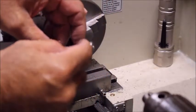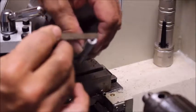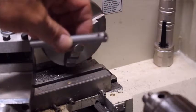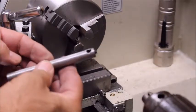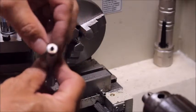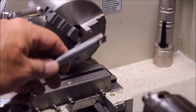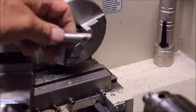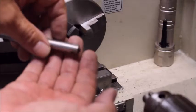I'm going to have to make this hole bigger and then file it square so that this piece of steel will go through. You'll see how much meat it has on each side, and then I'm going to cut this down to size — that will be my boring bar tool. There's the boring bar tool holder with a circular hole that we're going to file square, and you can see the little grub screw in there. This is not my original idea — I got it from somebody else, which is like most things on the internet, but I figured everyone does it a little differently so I'd make a video.